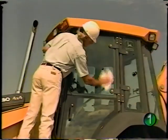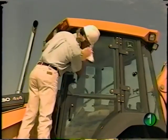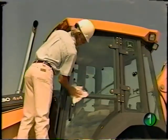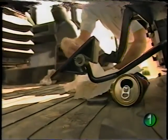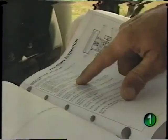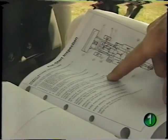G-Series backhoes have outstanding visibility on units equipped with a cab. Be sure to take a moment to clean the glass so you can see where you're going and who's around you. Also, a clean operator's station goes a long way in promoting safe operation — this includes keeping things clear of the pedals and levers. This concludes the pre-start inspection and daily service of the machine. For your convenience, a pre-start inspection checklist is printed in your operator's manual.